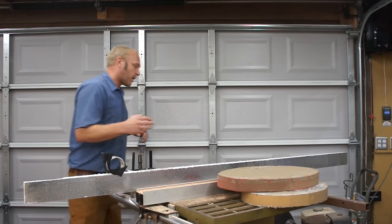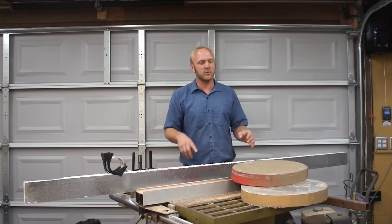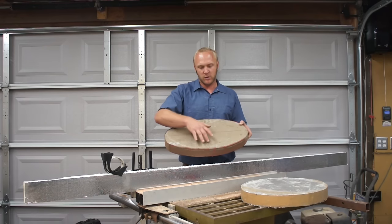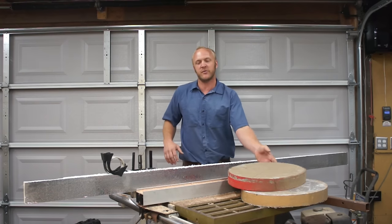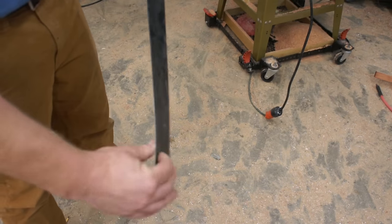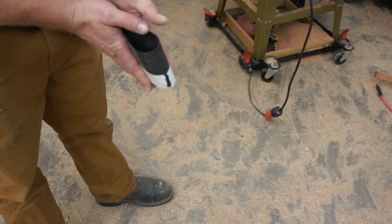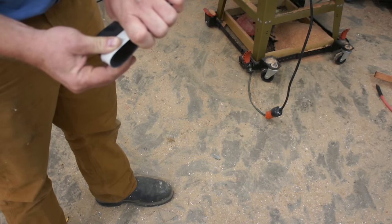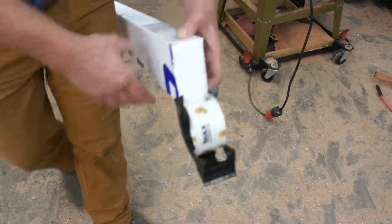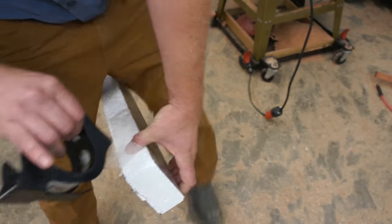Now when you're dealing with a round sink — a vanity or something like that — often those sinks will come with a cardboard template, which you can easily set on your foam and trace out. If you don't have a cardboard template, you're going to have to work off of a grid: take measurements, draw a grid, and come up with the shape that's going to work best for you. I mentioned earlier that the Z Counterform sink templates sometimes won't bend tight enough to fit in a sink corner. I've had a bit of luck heating these up — they do bend pretty tight — but sometimes a piece of foam is just more suited. In those instances, I'll pull that tape extra tight around the corner to kind of round it off.